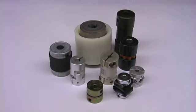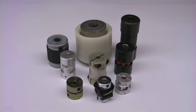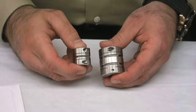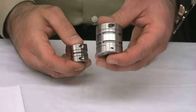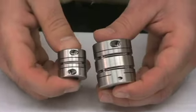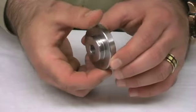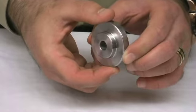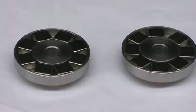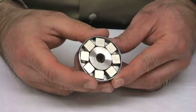SDPSI has lots of other types of couplings in stock such as joint cross couplings, spline type couplings, spider type couplings, or disc type couplings which come in one disc or two disc styles depending on the stiffness required for a particular design. Another interesting coupling solution is provided by our magnetic couplings, which use powerful magnets to bring shafts together. A quarter-inch air gap is created between the two coupling halves, which allows for angular offset of three degrees and a parallel offset of a quarter of an inch.